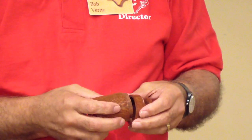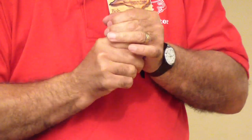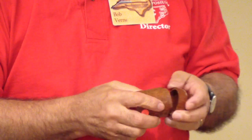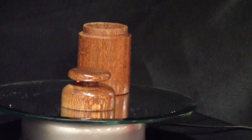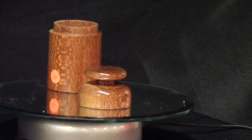But. Yeah. One of the problems with these tight lids is that wood isn't constant. It started raining a little while I was doing that, so I've given up making the top fit. I always give it the smallest amount of play in there, so as it may change in time, it doesn't jam on. Don't ask me how I know this. Not the hard way. I got one I can't take off. Yeah, I'm sure we all do.